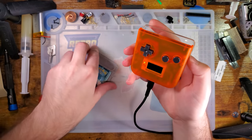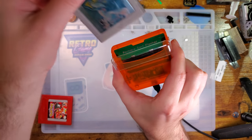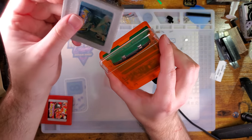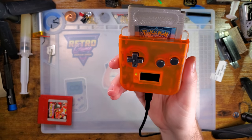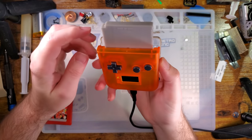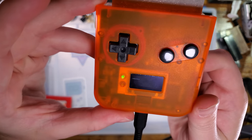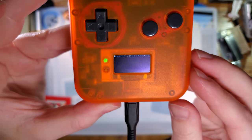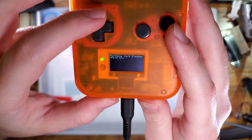I'm going to switch this off and insert my Game Boy Color cart. Do keep in mind this particular one does not have any of the chamfers on the cart slot, so make sure you have it inserted the right way around. It's not going to hurt your cart to insert it backwards, but it means the pins will be on the wrong side so it won't be able to read it. We'll hit 5 volts, and then we're brought to the main menu where we have the title "Portable Cart Flasher" — probably just edited from the stock firmware that said "Open Source Cart Flasher" — and then we have two options: Game Boy and About.